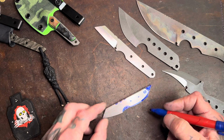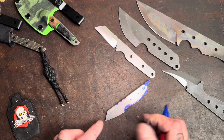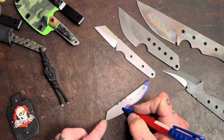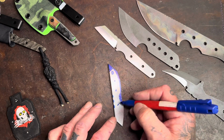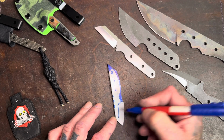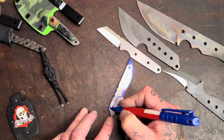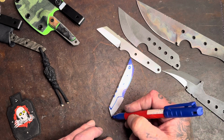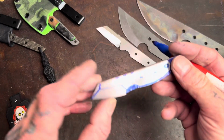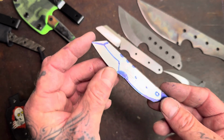Bink, right? And then I like to just sort of sketch out how the grinds will be. Now on a blade this small, I'm not going to do a sharpening choil. We already have that front finger choil, so sketch in our plunge line. Right, we'll follow the curvature of that blade, something like that. We'll stop short because we're going to do a chamfer. Bring that line down, make those two meet, and then from that point come to the point of the knife. Boom, something like that. And there you have a little one-off knife made from a scrap piece of steel.